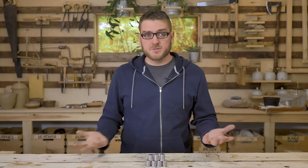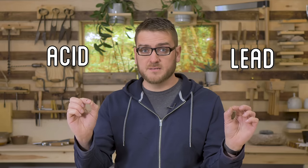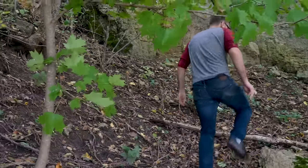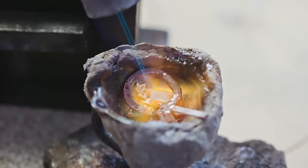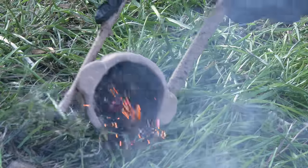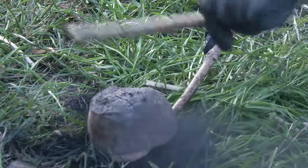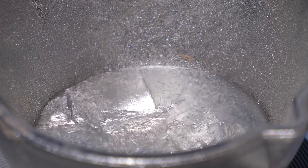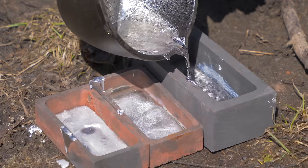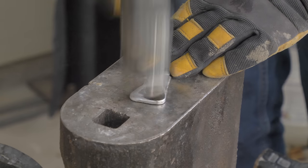With a lead-acid battery there are two parts: the lead and the acid. Thanks to our adventures collecting lead and learning how to smelt it, we now have lead to work with and can put it to use for a rechargeable battery. What we're really trying to do is maximize surface area, because that's going to increase the amount of power we can generate. So let's take some of these ingots, melt them down somewhere with good ventilation, pour out really flat sheets, hammer them even flatter, and use these as the electrodes for our battery.